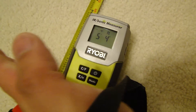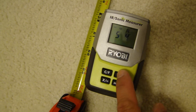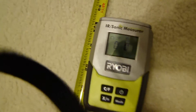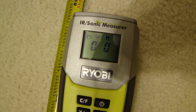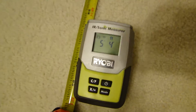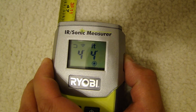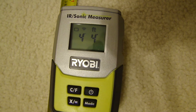...it's accounting for the actual length of this unit, which is about four inches. So if you butt this unit against a wall and do the measurement, it'll account for the length of the unit as well. I'll quickly show you the area measurement — I'll turn this off, turn it back on, it's at zero. If I do the area measurement, you see the square in the top left hand corner, I take a measurement first.